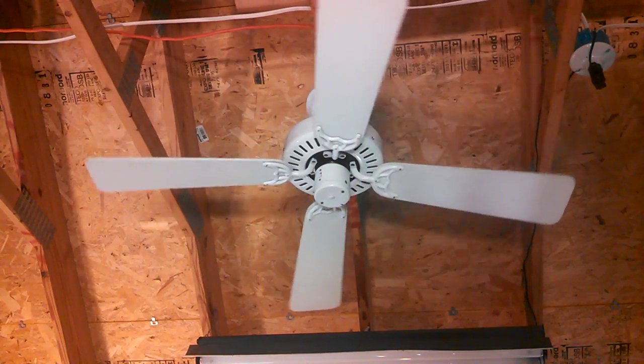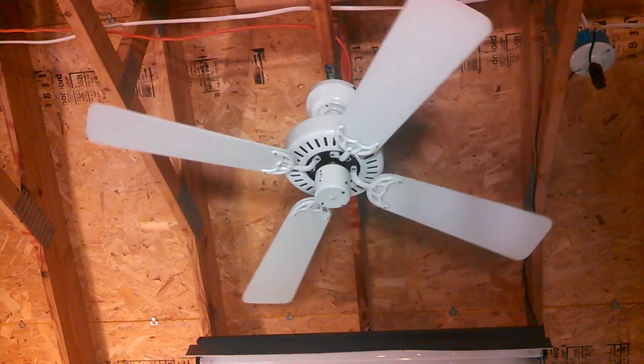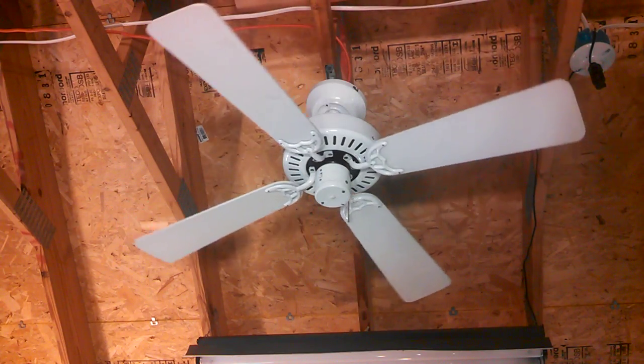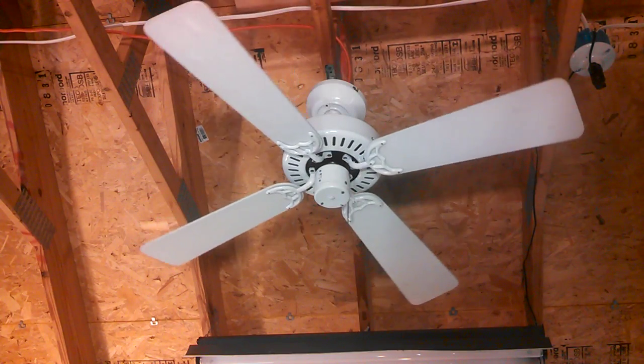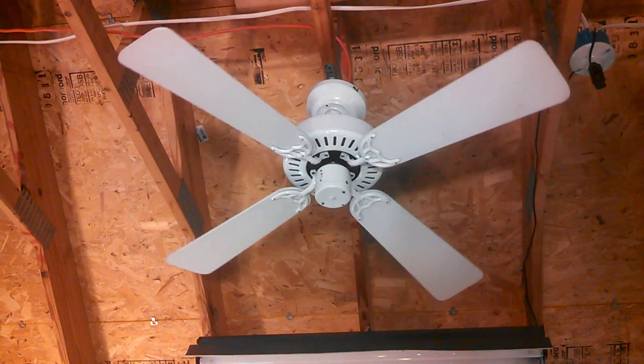And I said, wait a second, I know these work. Turns out in the back room of the salon, connected to the breaker box, was a dimmer switch or a solid-state control that no one knew existed. So the originals probably worked fine if they would have just turned them on. Sure. And so I replaced it with just a blank plate, so that they didn't have to worry about it, they could just turn the fans on and off with a string if they didn't know it existed.